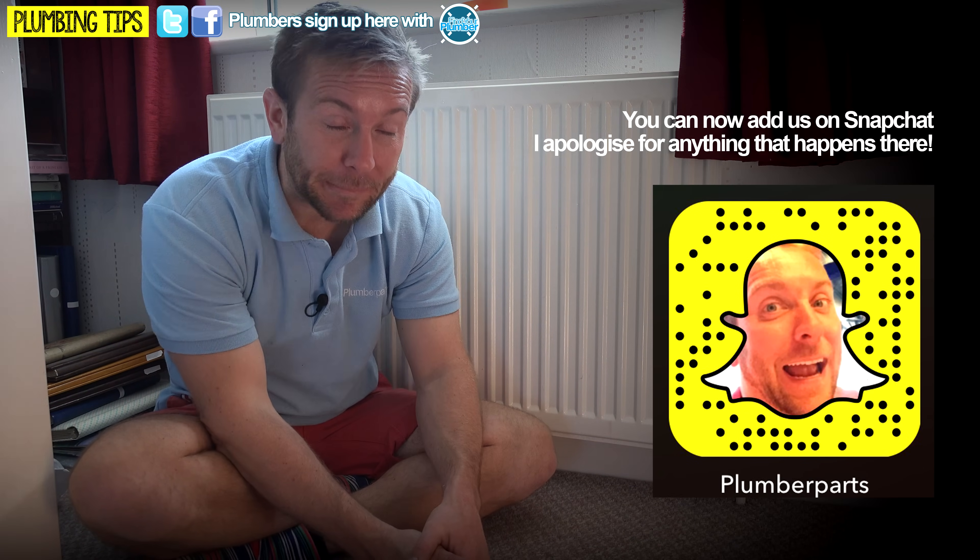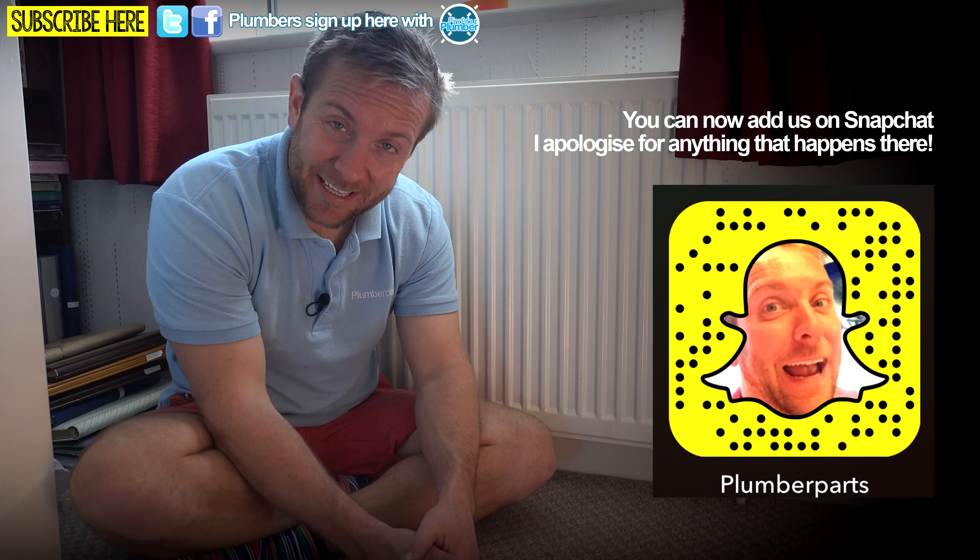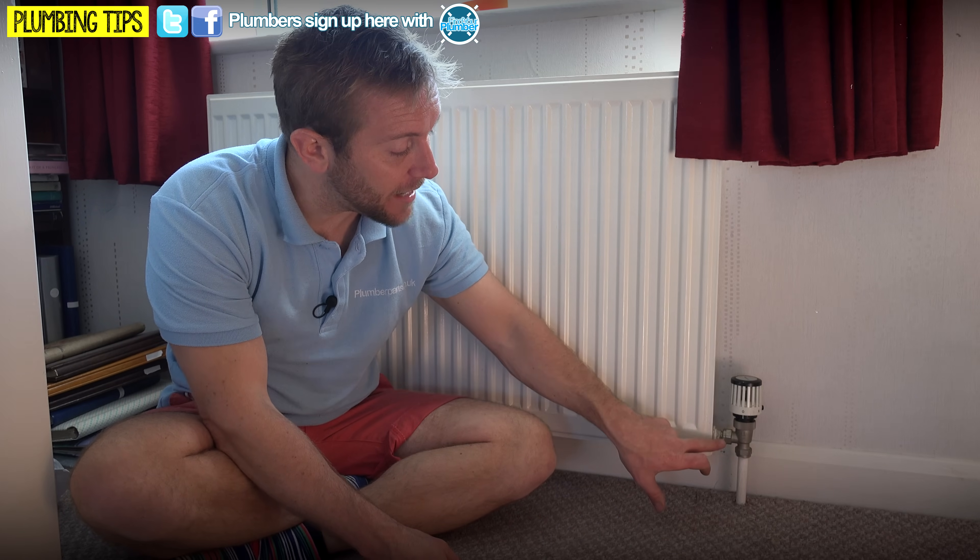So this video is a little bit naughty, because I'm going to be telling you how to do something that maybe you shouldn't need to know how to do. But sometimes it's actually easy to change a little radiator valve like this one here if you just have to slacken this nut off and this nut off without actually having to drain the whole heating system down. On a gravity-fed heating system, we call that pulling a vacuum. It's for quick little jobs — not when you're changing a radiator and doing a load of pipework. The pros of doing this is it means you don't have to drain the whole heating system out, which saves you time and saves the customer having to put another tub of inhibitor in.